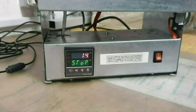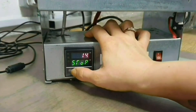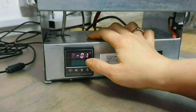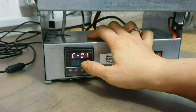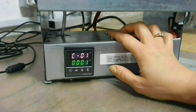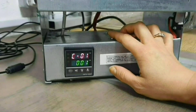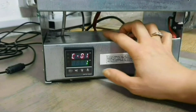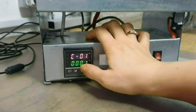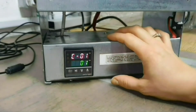Before we start the process of programming, I will tell you some rules. The first step is C01, where C means Celsius. Please remember that the C01 parameter is not the program parameter — it is just the minimal temperature after which your kiln will start working. If the temperature around your kiln is lower, the controller will not start working. C01 always must be 0001 for any program.